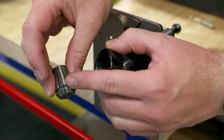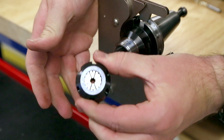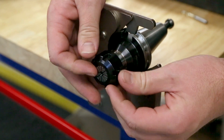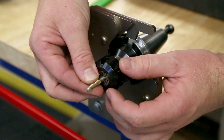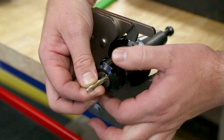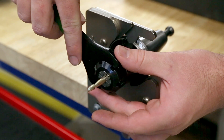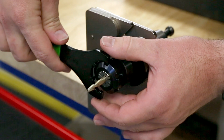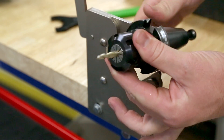Notice the groove in the ER collet — the groove is retained by a clip ring embedded in the collet nut. Clip the collet into the nut by pushing while tilting. A firm click should have been heard and felt, and the collet should not easily fall out of the collet nut. Screw the collet nut part way onto the tool holder. Insert the cutting tool, ensuring the collet grips only the shank and not the cutting flutes. Tighten by hand first, then using the wrench with a firm pressure applied. Ensure all teeth on the wrench are engaged with the collet nut. Remove the tool and holder from the fixture — it's now ready to use.